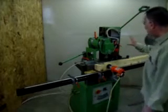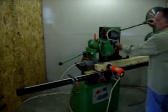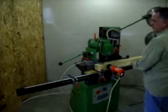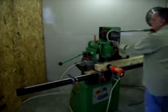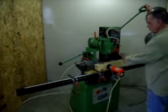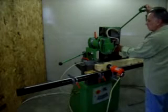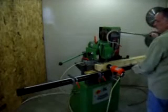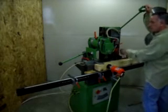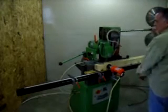The stock setup on here is really interesting. This lever here is the back stock, so you can set how far up you want to come so you don't have to waste time going all the way back to the top each time. You can pre-set the stock down so it's just a half inch or three quarters away from your wood, depending on the length of the chisel. There's a graduated scale for setting the depth of cut. On this side there is a second depth stop so you can do two different depth settings. If you want to do haunch mortises, you set this for the second depth, flip it over, and that stops you at the second depth. Flip it back up and continue to the first depth.